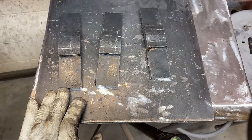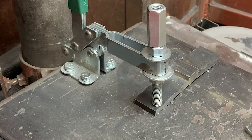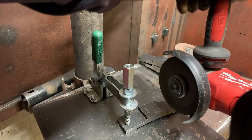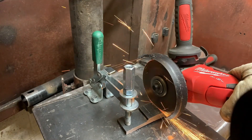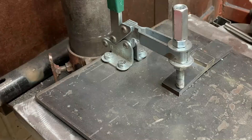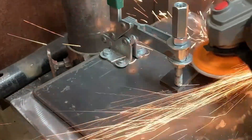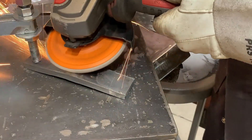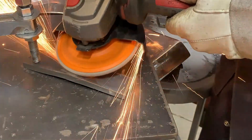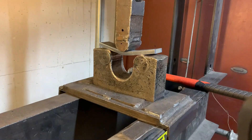Then I'm going to draw my lines on that backing bar. There's an area on that backing bar that's fused with weld metal, so what we want to do is cut off that excess on the outside — we can do that one by one on each of them. Once those outside pieces are removed, we're going to hit it hard with that angle grinder. This is where you're going to create some dust, so get that respirator on. Then we're exactly where we left off, whether we're oxy fueling it or using the mill. We're able to process that, finish it off, tidy up those coupons, and bring it to the bender for destructive testing.